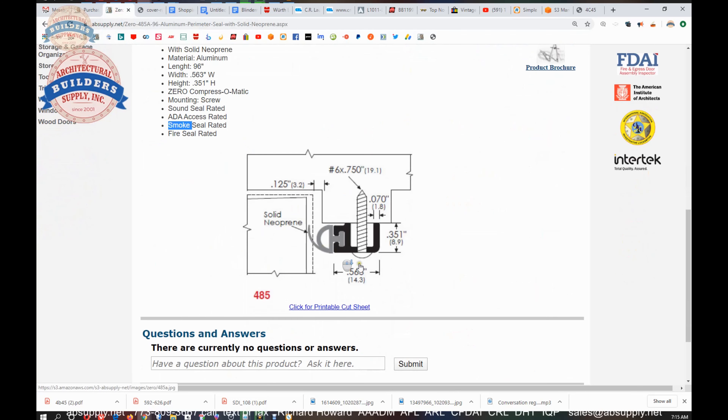There's a cross-section of the item here. What they're attempting to show is that you're going to have a seal on the door when you get down to an eighth of an inch between the face of the stop and the face of the door — you begin to make contact when the door is still slightly ajar. You will have substantial surface area of contact. An eighth of an inch is actually a little heavy; the distance from the face of the door to the face of the stop when closed will probably be closer to around .090.